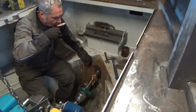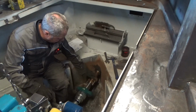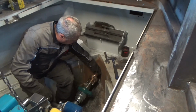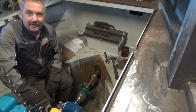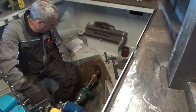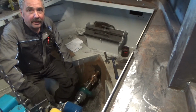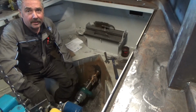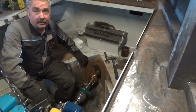And they get welded in, and then they support this whole system. And then we've got to weld this boss in. That'll be fun getting underneath there to weld. Not a lot of room under there, but the main weld will be fully welded on the outside, so that's easy to get to. We can use some low hydrogen rods on the outside and weld them on with that. Then get the weld tested. That's it, I'll have a measure and we'll get some plate.